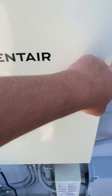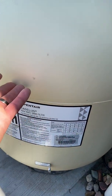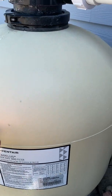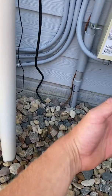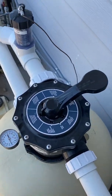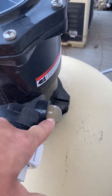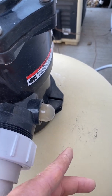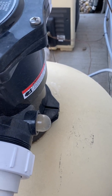Then we turn this handle to backwash and turn the pump back on. What backwash does is the water goes in reverse through the filter, lifts up all that debris out of the sand, then takes it to the waste line, which either goes inside your house or out to your yard. We do this for two minutes or until the sight glass right here clears up. It'll start clear, then get dirty, then eventually clear back up, meaning your filter is clear from all the debris caught in the sand.